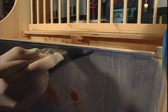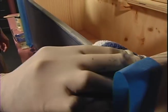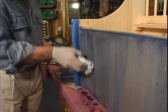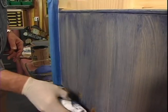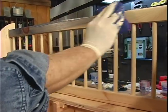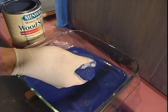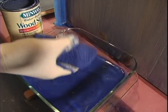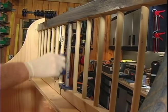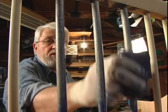What I like about this finishing technique is that I can match the color of the furniture to fabrics, carpets, or walls, while at the same time allowing the wood grain and texture to show through. The resulting surface has depth and character. On vertical surfaces, I usually start at the top and work downward, catching any drips as I go. The staining pad is especially useful on spindles and turnings — wrapping it like this allows me to apply the color in one motion.